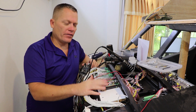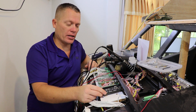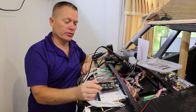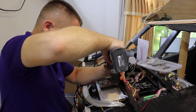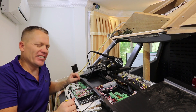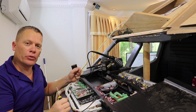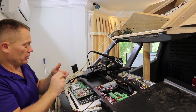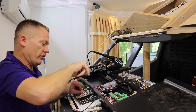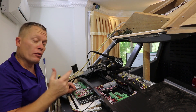Now that the left-hand EFIS is sorted on the Arduino board, I'm going to fit the spare Arduino board here for the right-hand side for the First Officer — just so it's there and I don't have to take the window assembly off again to get to it; I can just take the glareshield off. I've tidied all the wiring up and it's all laid out. All I need to do for the next step is daisy chain the grounds to each of the boards so all boards are connected ground-wise together. I've got simple shorting links to fit in the boards, and that's the sole purpose of these quick-release connectors — so a board can be removed or replaced as required.